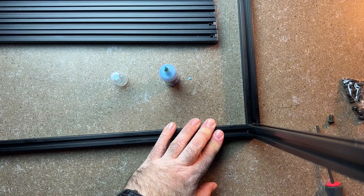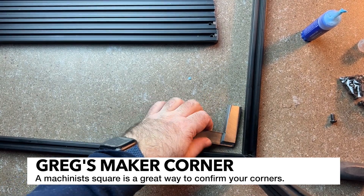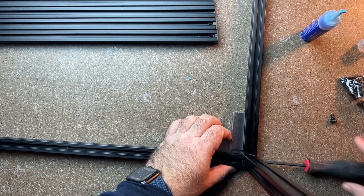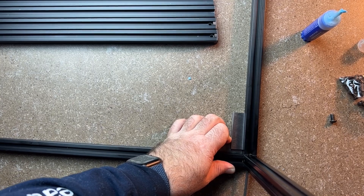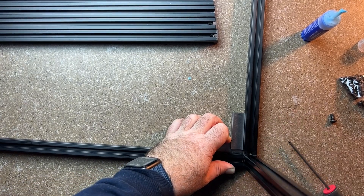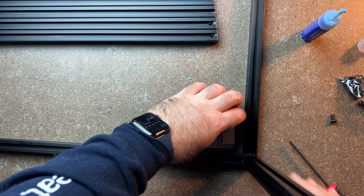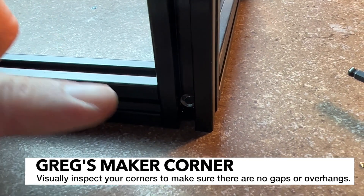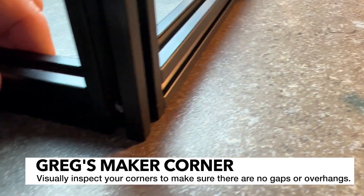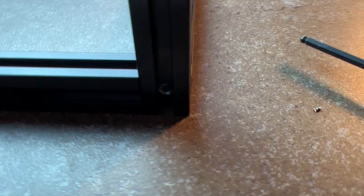That's nice and flat — there's no bounce in it, looking good. If you have a machinist square, these are really helpful in making sure your corners are nice 90-degree angles. You can hold it there while you're tightening things up, keeping it nice and square. I always like to tap the top of the extrusion to make sure there's no bounce. When squaring your extrusion up, make sure there are no gaps anywhere and that everything is nice and flat across all three extrusions. If you have any kind of gap, you need to push things down and square them up.